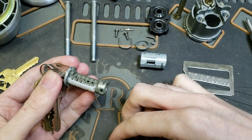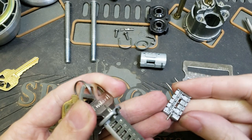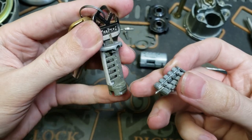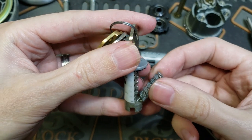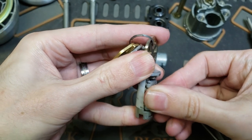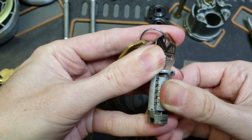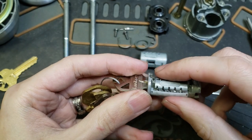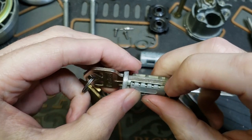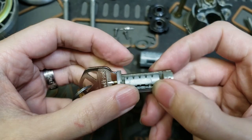Very carefully. It's okay — we didn't drop anything, just shifted one of those wafers a little bit. So what we want to do now is very carefully put this little spring into this channel like that. Compress that spring carefully, and slide those two halves together like that. When they snap together, we're going to let that release. All of these wafers should look like they're all lined up at the same distance from the edge of the plug — all the same on this side, and all the same on this side.